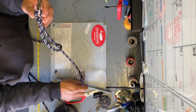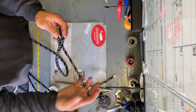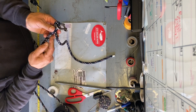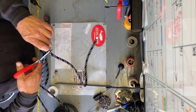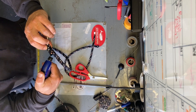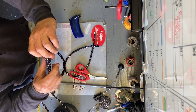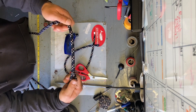Now for finishing the splice. The splice is essentially done but there's a flap of cover. One option is to bury the cover back inside itself using a fid. The quick method I use is to cut it off with sharp scissors right there and then heat it up with a torch — my wife calls my hands gloves because I can touch molten stuff — and melt it over nice and smooth.